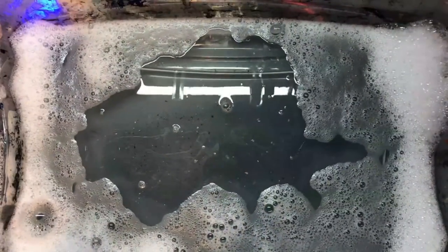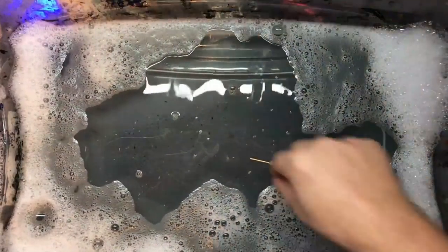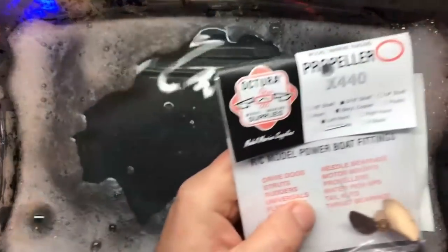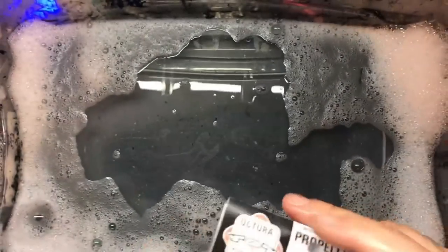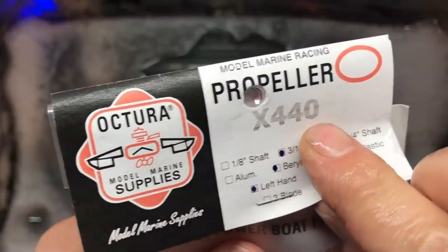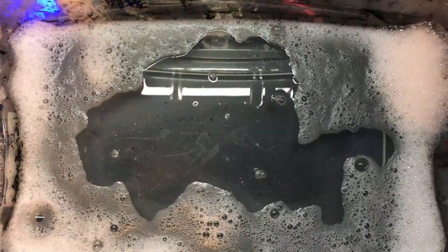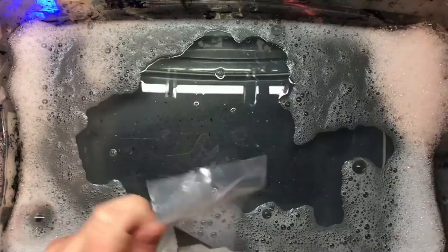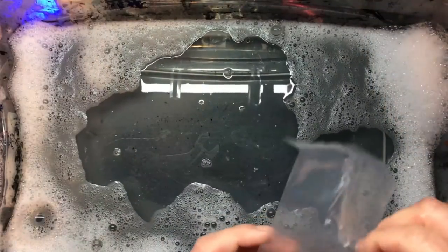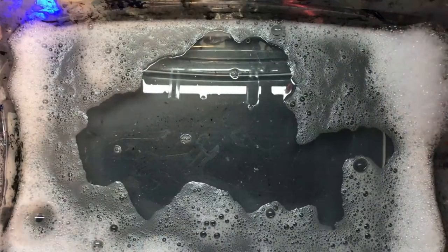We're going to do the prop first - sharpen and balance it. The one we're going to be using is a 316 shaft beryllium copper. It's the Noctura 440, by the way. Now beryllium is a very, very nasty, horribly carcinogenic material in its dust form when it gets into the respiratory system. I've been to beryllium foundries and trust me, it's not the best time you'll ever have.